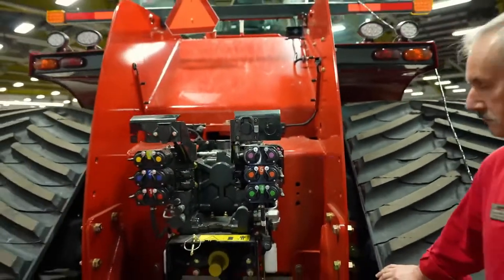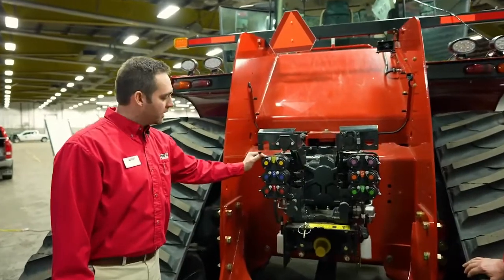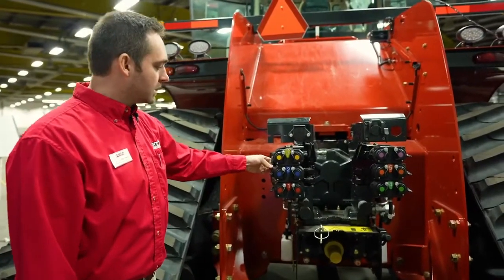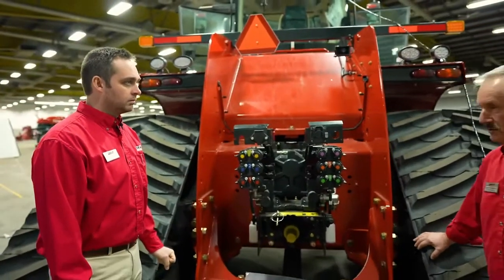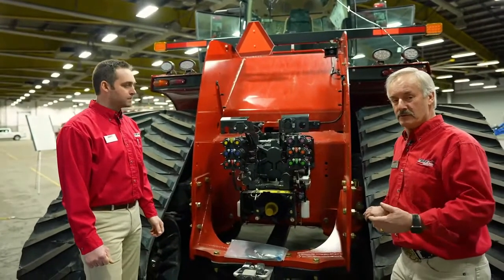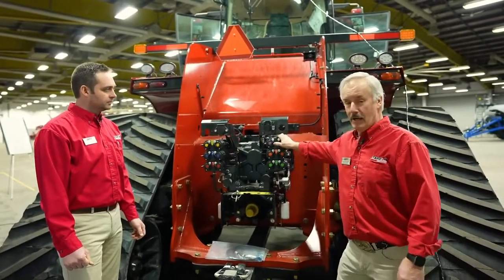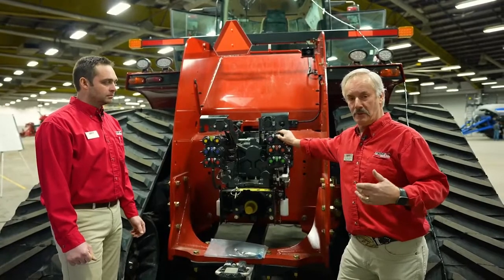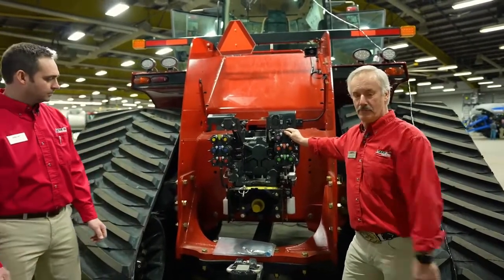Along with the new valves, we have these pressure relief handles on each valve, which is new for 2021, which is definitely going to assist in coupling and uncoupling the hoses under pressure. Under pressure, that's correct. Because if you look at the previous tractors, before we went to these couplers, I always refer back to the point that if you're going to be hooking up your air seeder, you're probably best to just shut the engine off and hook up your lines.